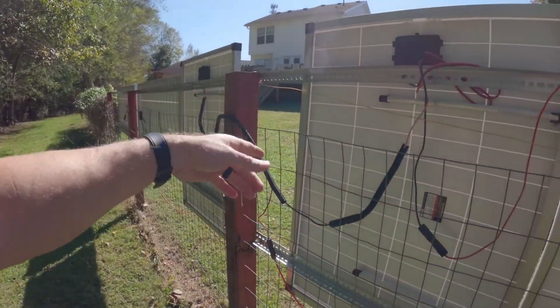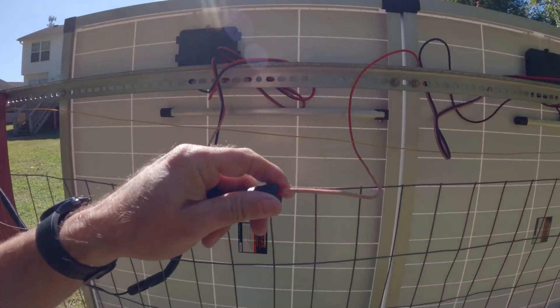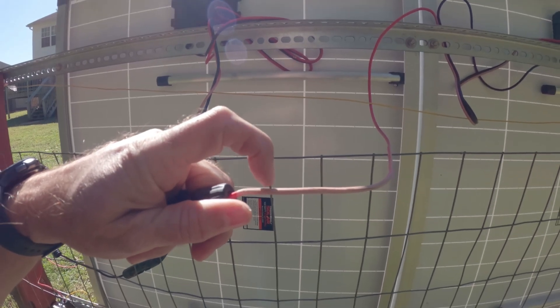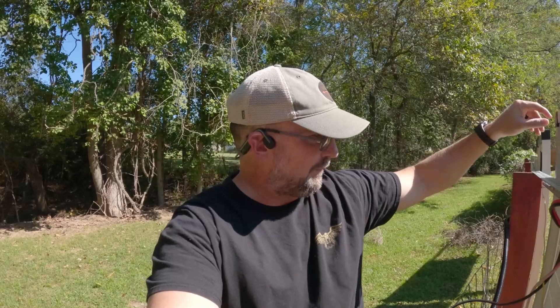I started running the tubing over here this morning and I'll tape it up to keep the exposure down. What happened was the wire had become so brittle from sitting in the sun that when a thunderstorm rolled in, water got into the cracks and exposed wiring made contact with the metal shed roof, which shorted and grounded the system out. I did have an earth ground coming off the side of the shed from the panels, and I think that might have prevented a fire.